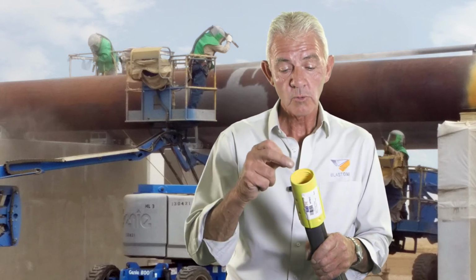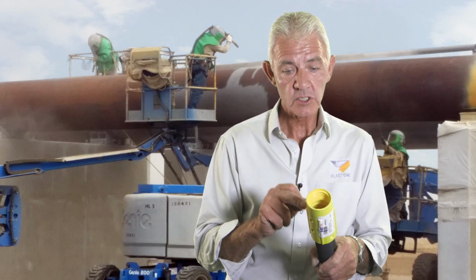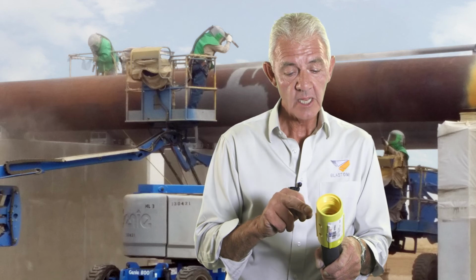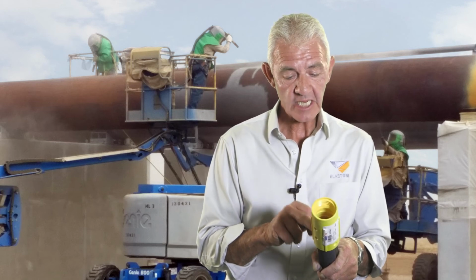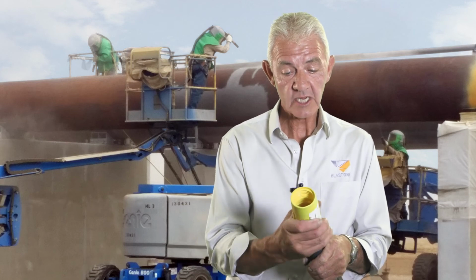When you put the screws in the hose, make sure that the screws do not penetrate the hose wall, which inadvertently will cause the grit to come up through the screw hole. So the screws are only a primary securing. The secondary securing is an adhesive such as silicone or Sikaflex.